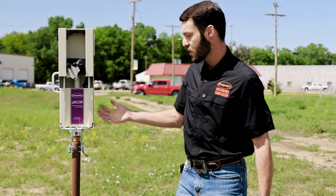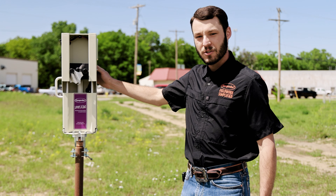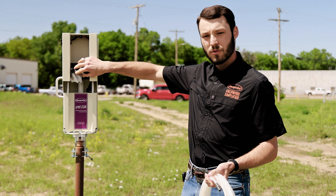I've put the electric actuator on our inch-and-three-quarter rods, tightened our universal rod clamp holder, and put our 18-volt battery onto the back of the actuator. What I'm going to do now is send our pump and tubing downhole, and show you how to attach the tubing to the block.